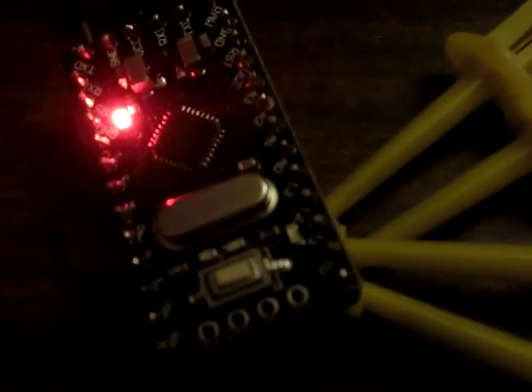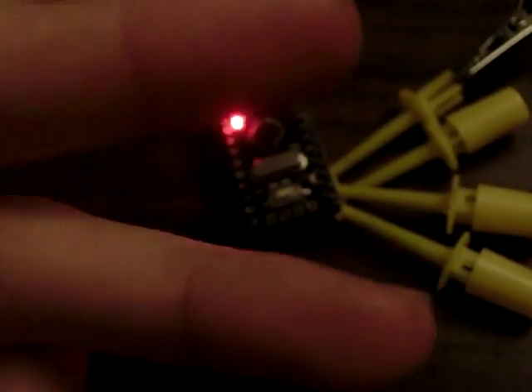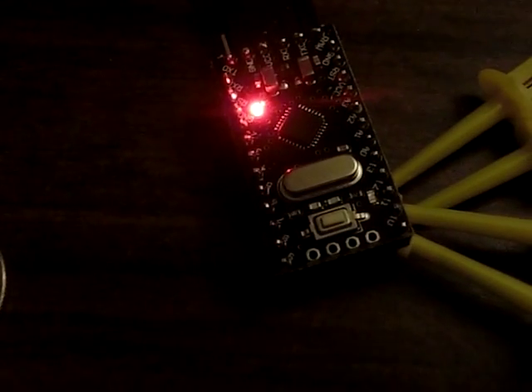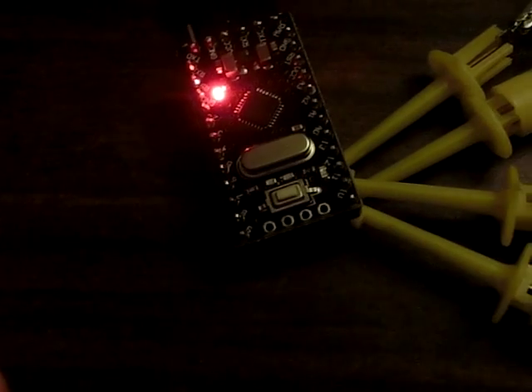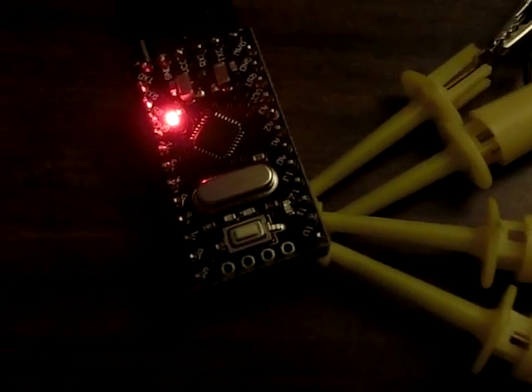The code is kind of a mess, because I just manually wrote a square wave. It basically takes 2 pins, goes plus, minus, and then switches it — plus, minus. And the minus one, the off one, is just shorted to ground inside the thing. I should probably put a step-down resistor, but the pulses are so short I don't think I have any power concerns.